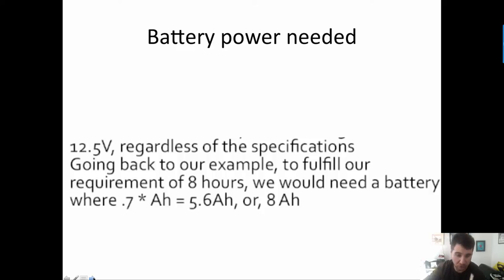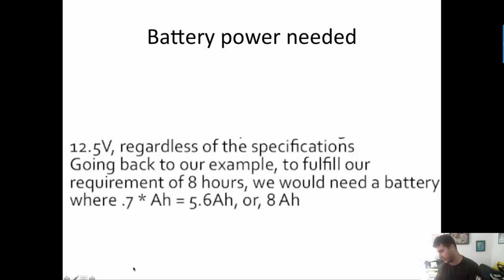There's a limitation, and there's a little graph that he shows, which is pretty good. Some radios, for example, under 10 volt or even 11 volt, won't work because they don't have enough power. So even if your battery is a 12 volt, if you go down under, let's say, 11 volt, if you're at 10 volt, you still have 10 volt in your battery, but you cannot use it for radio, because your radio won't function with that. So that's what he's talking about: how much percentage of that battery can you use. He was showing a pretty good chart about the percentage of watts that you have from your batteries. So I highly recommend that little presentation. I've learned a lot from that.